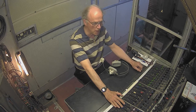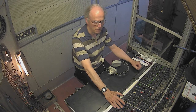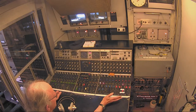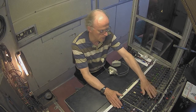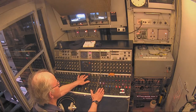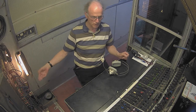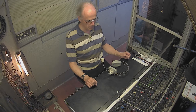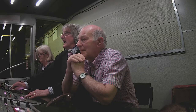The output of the sound desk would go to line sending amplifiers and then would be sent down probably Post Office lines if it was going back to the studio. There is also a tape recorder for playing in opening and closing music. The communications are on a few buttons in the middle of the sound desk, and the actual connections with the outside world were made on a jack field on my right-hand side. Also, this sound desk was in mono — we did not have stereo sound in 1970.